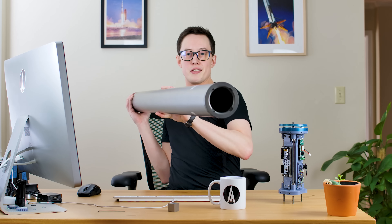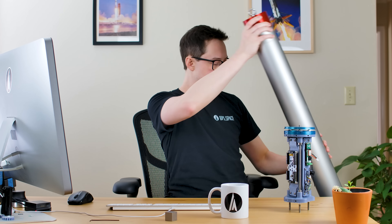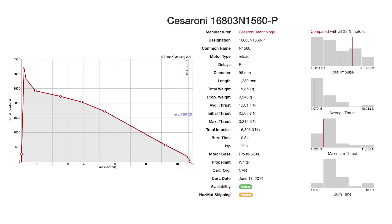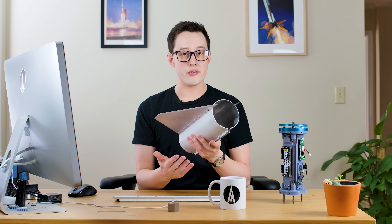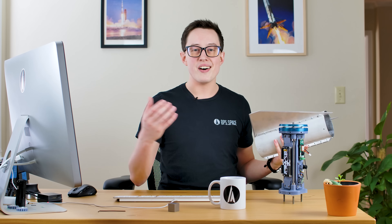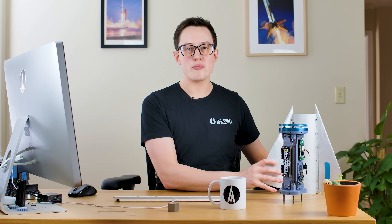This is the motor section, filled with ammonium perchlorate right before launch. It's going to fly an N-1560 motor which burns for roughly 10 seconds. The fins were originally designed to be custom aluminum fins — very pretty and tri-symmetry, with three fins around the edge of the airframe. We cannot do through-the-wall fins to strengthen them because on the other side of the airframe is propellant — we have no room to go into the vehicle. Also, to properly certify the flight you cannot use commercially available fin cans, so I'll be making my own fins out of G10 and then doing a tip-to-tip fiberglass layup to reinforce them.